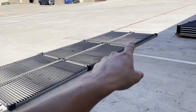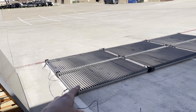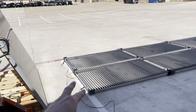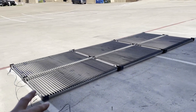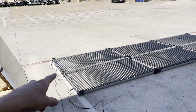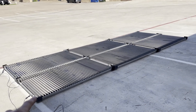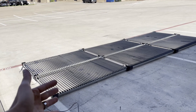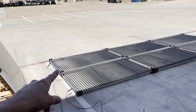One way of doing that would be to take these three and stick them up there using all the existing wiring, except this is now an MC4 connector that won't connect correctly to that Tyco connector. Problem with having different connector types. So what I'm going to do — because when I sell these, a lot of people are going to be putting them in one long parallel string and they would need both to be MC4 — is unconnect this, put MC4s on there, and use a branch connector at the end. We'll put these two strings into parallel. Without fusing, you can do eight of these in parallel, up to 23 amps. The short circuit on these is about 2.6 amps, so eight in parallel — this is six, no big deal, no fusing needed.